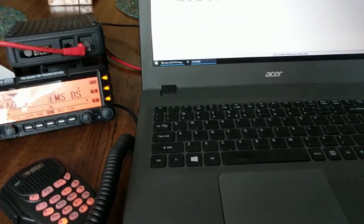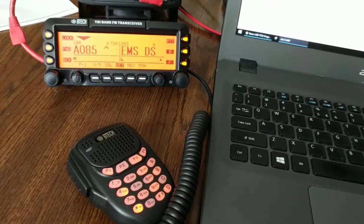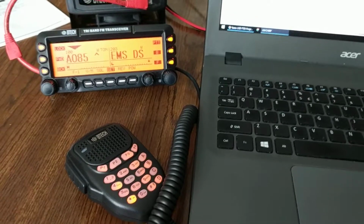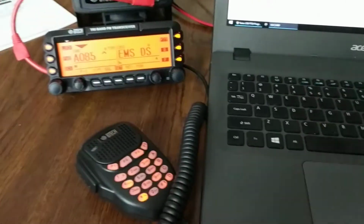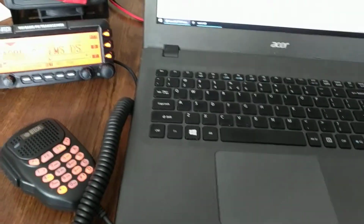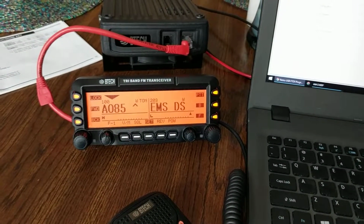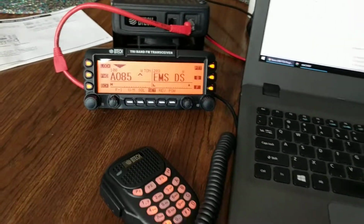Yes, I think so. I haven't had a chance to... So on APRS, Baofeng for a time was marketing a module that would work with this, and if it's anything like the, name escapes me, the Vero, I forget, Vero Telecom. If it's the Vero Telecom spin-off, then they have an APRS unit that goes in line with the control cable of the remote, and attaches also directly to the mic input, and then you have to plug your microphone into that unit.